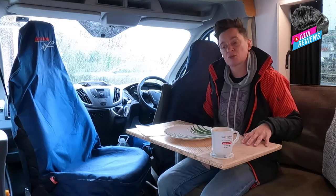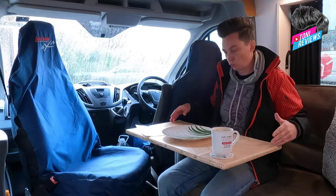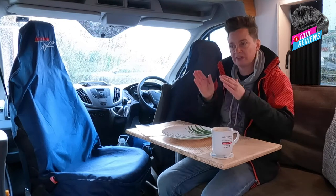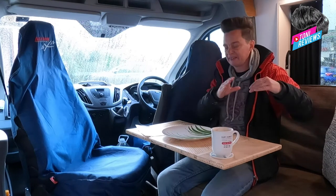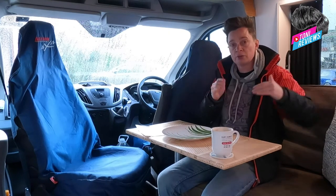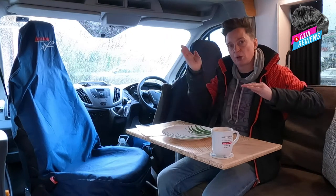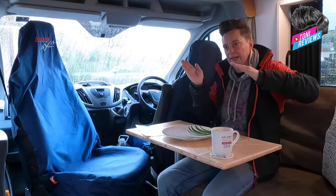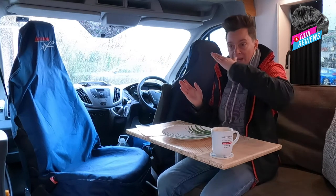On the subject of clamps, I bought two large sash clamps, as you saw in the video. Ideally, if you're making a pattern, the Michael Alm video that I watched, he set his grain at 45 degrees, and he set it over four sash clamps. You really do need four sash clamps if you're going to set that angle, because you're staggering your ply to go up like a set of stairs, so they eventually go in an angled direction. With only two sash clamps, I didn't have enough to angle my ply like that.